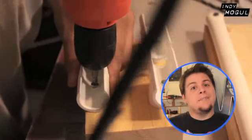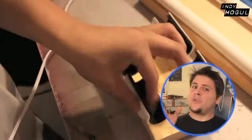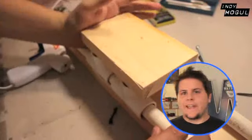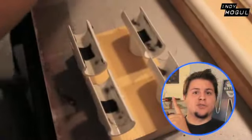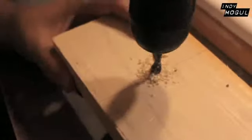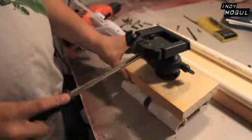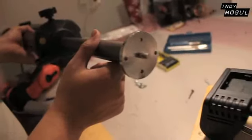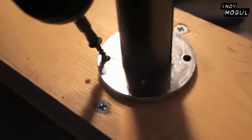To have the PVC pipe T-shapes slide on the PVC pipes themselves, I thought we were going to have to use full pieces of felt. Turns out that just stopped it from moving, so we just used little pieces to put over the screws, and that worked perfectly. Then I drilled a hole through the middle of the top sliding piece, put the quarter-inch bolt through, and attached the tripod camera mount. Our tripod's quarter-inch bolt wasn't long enough to stick out the other end of the wood, but if yours is, you can just use a wing nut to secure it. We just screwed our tripod right into the wood.